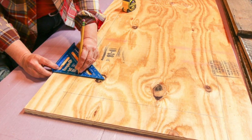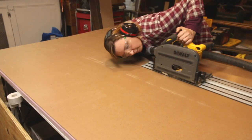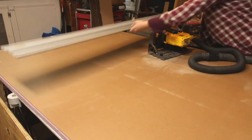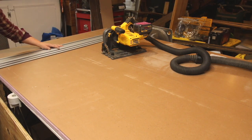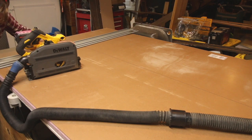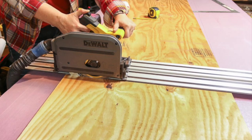Time to cut your materials. Measure and mark the size of your door on the plywood and Masonite beadboard sheet. Be sure to add 2 inches to your door opening so the barn door will cover the opening when hung. Cut your wood with a circular saw or, if you have one, use a track saw. I found this battery-powered track saw by DeWalt to be invaluable for cutting down large sheets. Because it runs on batteries, I can even bring it to the store and cut the materials in the parking lot if necessary.